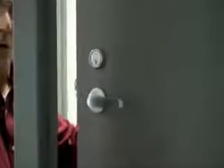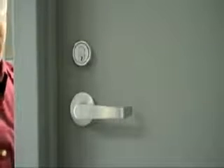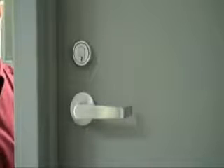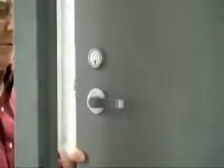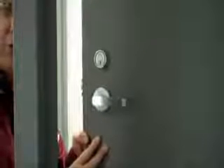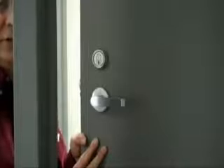Now I'm going to close the door and check to make sure that it is engaged into the latch, there's no rattle, and it closed and locked very easily. It closes and latches and engages without having to push or pull on the door. At this point, we have now had the opportunity to see the proper installation of the Dorma Architectural Hardware M9000 Series Lock.